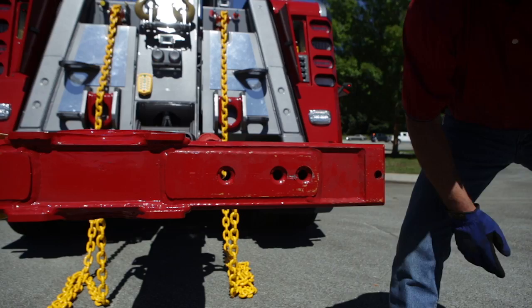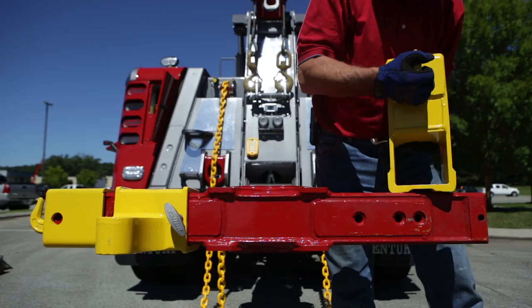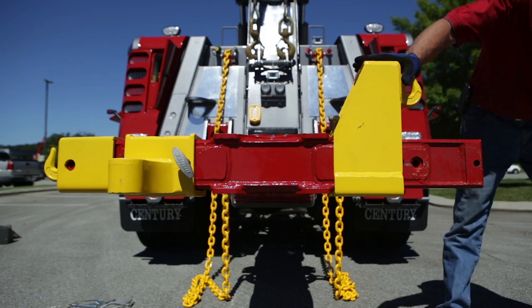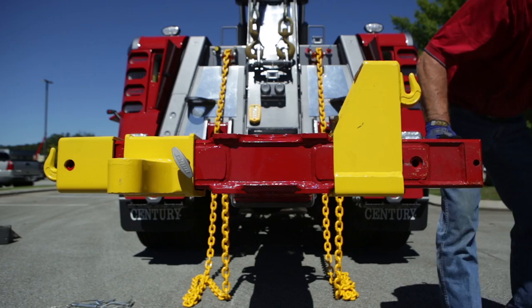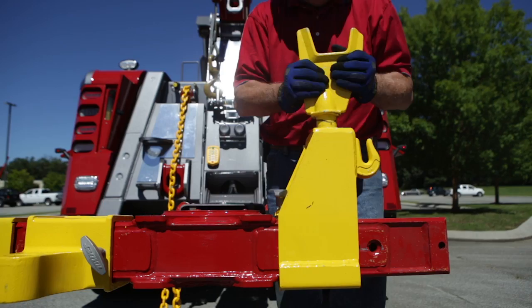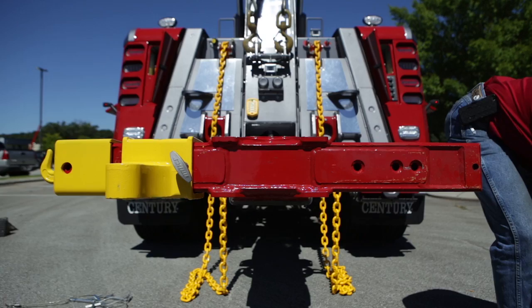Now I'm going to pull this off and go to the fork holder with the riser over there. You can see the riser — it can go either way onto the towing attachment. The hooks can face in close to me or apart; it doesn't matter. The other nice thing is it allows you additional height on a frame fork. Taking a medium fork and adding a riser gives additional height, which is very useful for tall loads like a flat rack.